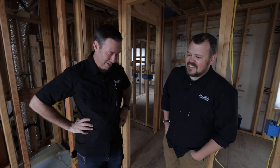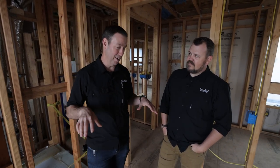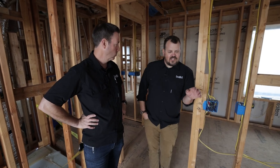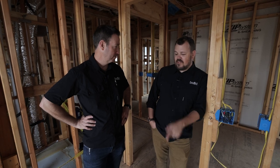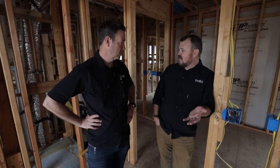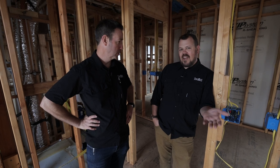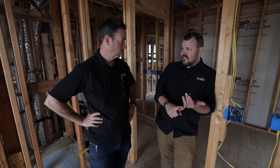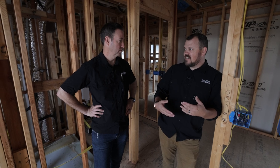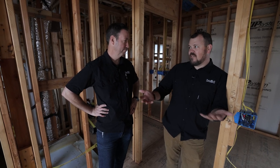Good. Thank you. So, Jake, last time I was here, this was a concrete slab, but now there's Advantech down. What's going on with this house? What does Steve design here? So this is actually something that we've done quite a few times on our project. Steve and I have two houses going right now that we're doing the same thing. We are simple turndown slab, or this is maybe a post-tension slab. And now we have the ability to be insulated on the top side, so that insulation didn't have to go in before the concrete guys got here and then them not mess it up.